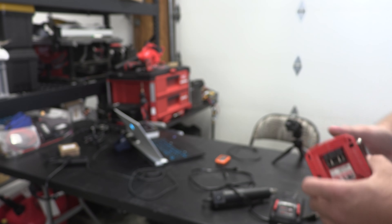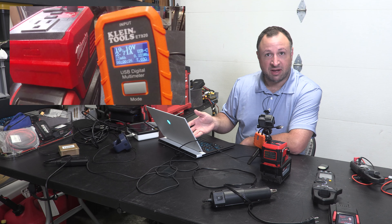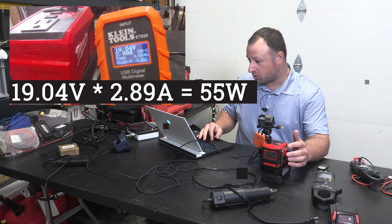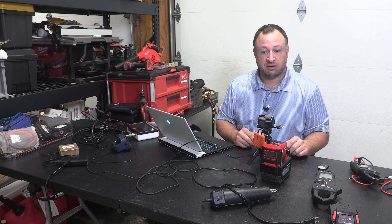We have our Klein tools here plugged in and my laptop here. This laptop is designed to charge at 130 watts as the Dell OEM adapter. It will charge and operate pretty well at 90 watts. 45 watts is basically the limit of what it'll do, and really if you're actually using it for anything real, 45 watts is going to keep everything throttled — the CPU alone boosts up to 55 watts on this, so that will keep it zeroed. This thing is rated at 45 watts — it says there on the placard and on their marketing materials — but as we can see, this thing is now pushing 53, 58 watts. So it's well above its design rate. The laptop is at 55%, so it's charging. We've probably got enough detail — let's dive into some of the more juicy and controversial things.